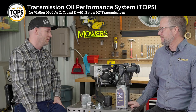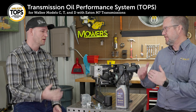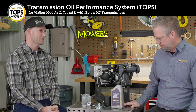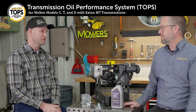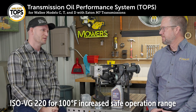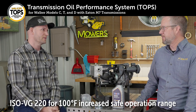Early on, the test stand helped us determine that we were a little bit marginal from an oil standpoint. Over a year ago, one of the first things we learned was that we needed a little more oil viscosity, which really led to the Mobil SHC 630. Based on our real-world testing of where our transmissions run temperature-wise, we determined we needed to step up our viscosity. This oil increases our upper temperature limit from a viscosity standpoint by close to 100 degrees, so it gives us nice margin on the top end to maintain that internal protection we need for the transmissions.